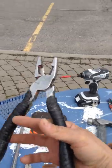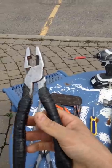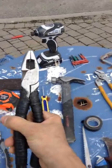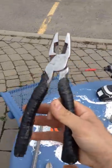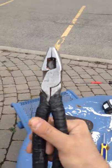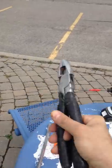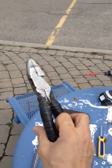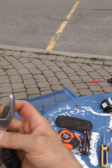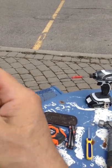Pliers are a main tool for us, along with strippers, hammer, and screwdrivers. You want a good decent pair — they should be able to cut the heads off nails, pull stuff apart, handle renovation work, and chop wire. You want the cutting edges to really dig in and sever wires cleanly.